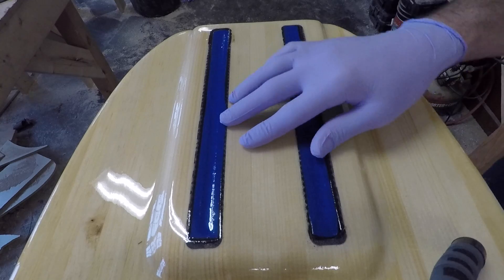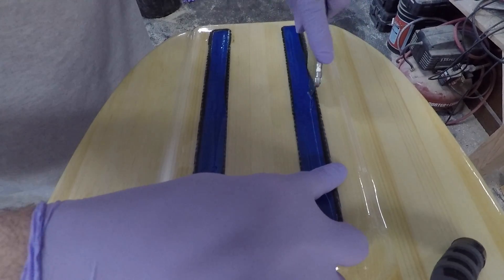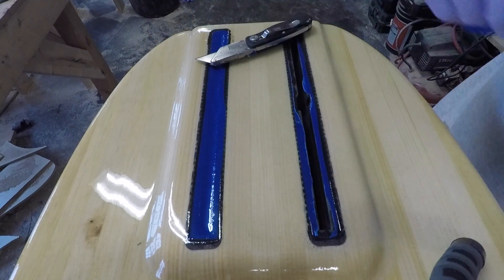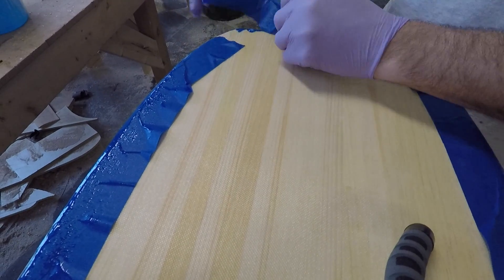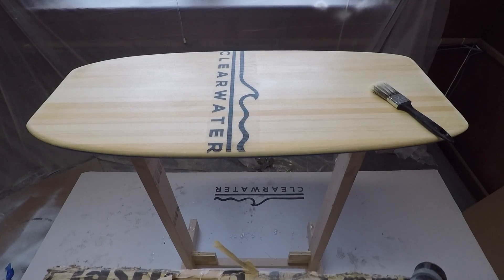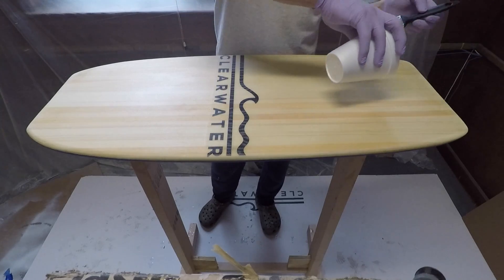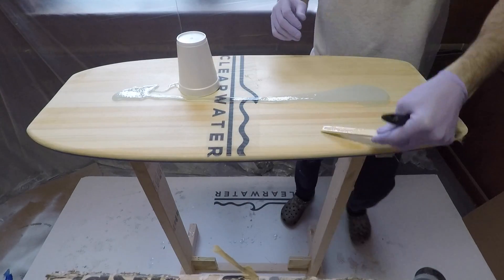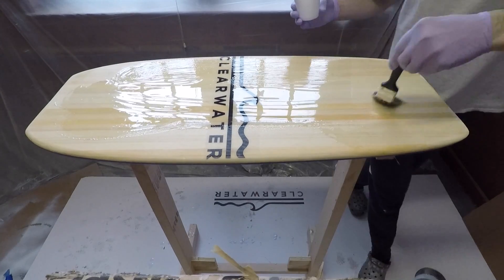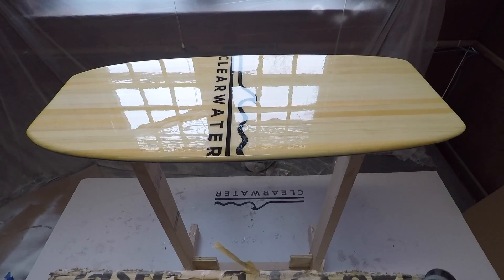That gloss coat is nice and hard. You can now see the result — I'm going to come in here with the knife and start to get the tape out of the boxes, and also get rid of this tape along the edge. Just as we did before, I've flipped this board over, have taped around the bottom perimeter, now I'm just going to lay down the epoxy and gently brush it out. That layer is on, everything's looking good and we're just going to let that cure.